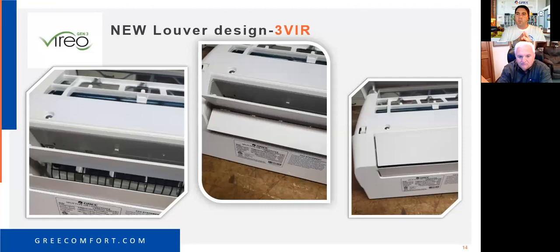The next difference on the 3VIR indoor high wall mount is that it has 2 louvers, which is different to me. Usually you just get the 1 louver. This one actually has a top one that looks like your normal one, as you can see on the picture there. And then it has a bottom one that kind of seals that area when it closes. And it also diffuses the air in 2 different ways, one going kind of straight out and one that can angle down a little bit.